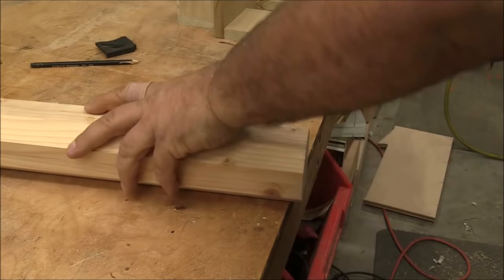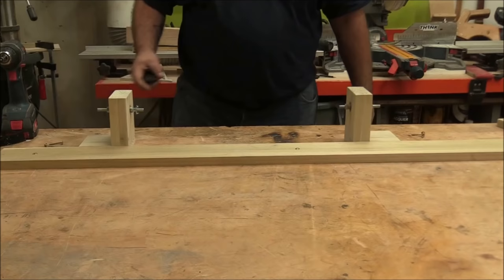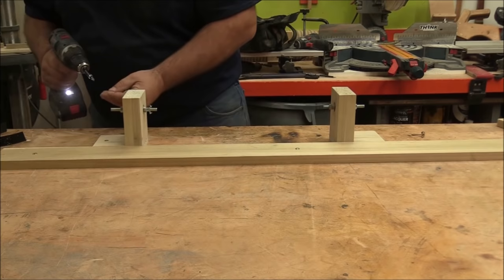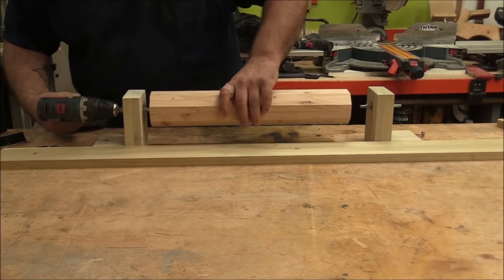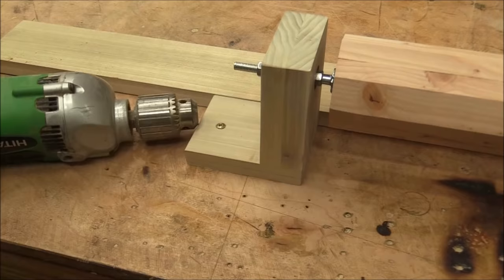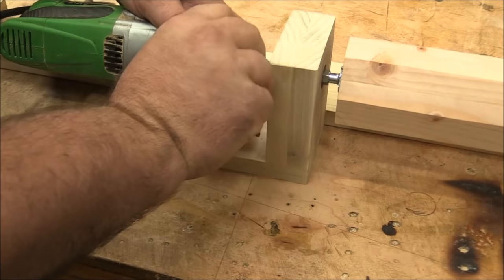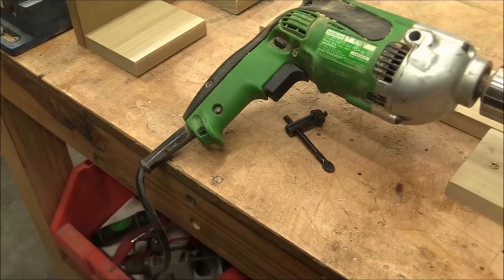That's really all there is — you build the head stock and the tail stock, and then I took some scrap wood and drilled a quarter-inch hole in each end of it, centered it out, and screwed one side down to the bench. Using my cordless drill I threaded it into the holes I drilled and did the same thing on the opposite side and secured it. You can use a cordless drill for this but you can only go in short spurts otherwise you'll burn it up, so I'm using a corded drill.